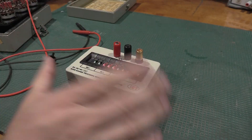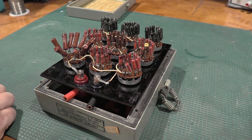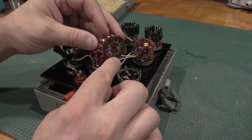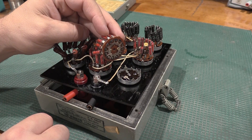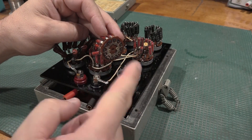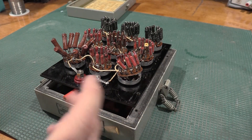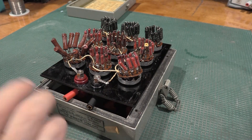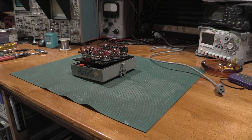We're going to have to tackle the old box and take a look at some of the contact resistance. The way this switch is put together, there's a moving portion at the bottom which just wipes and bridges the contact between the ring and the pad as it goes around — that's how it selects the resistor of choice. I have to clean this pad and these contacts on every single one of these. I've used Deoxit and a couple of other things, the usual suspects, and it's a little too far gone for just general purpose switch cleaner, so we're going to have to get a little more aggressive.